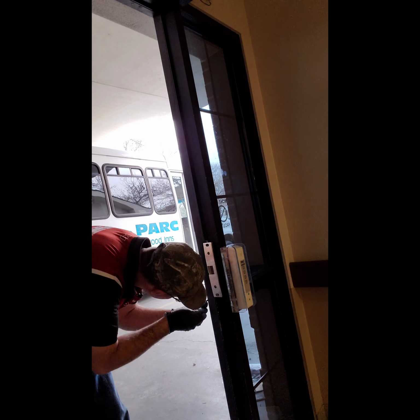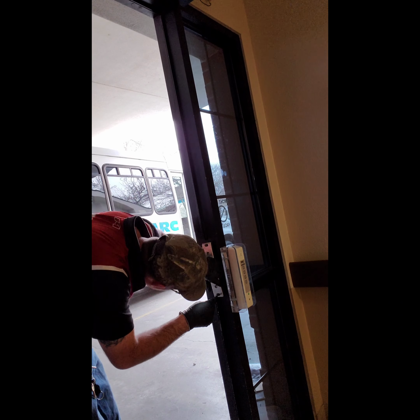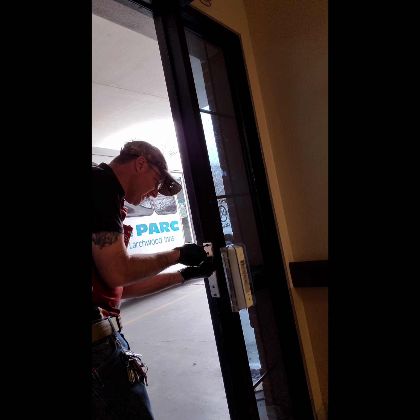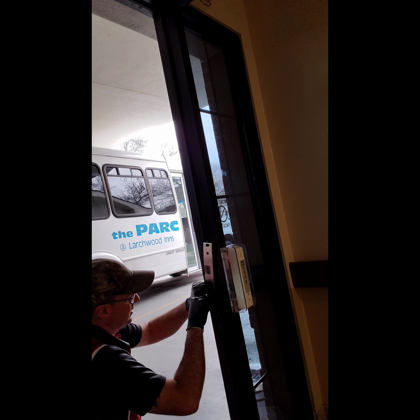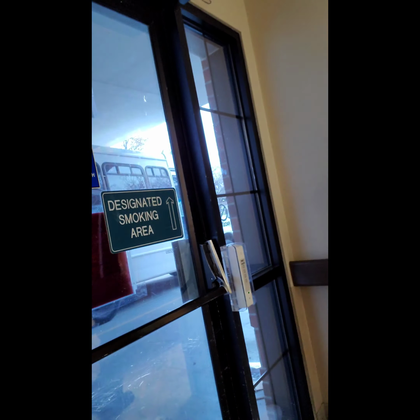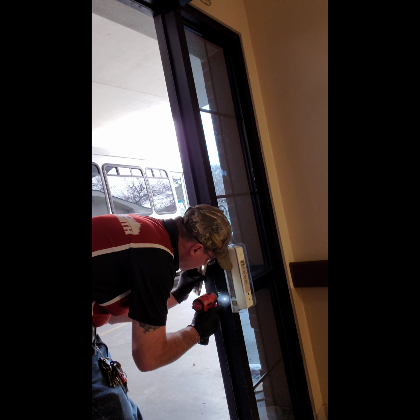There's a 12 and 24 volt plastic connection on that electronic strike. And the reason I had to open that up wider and actually angle it up was so that that plastic connection can actually fit down into the hole. That's what I was doing when I was making that hole. Probably 1/2 inch and then angled up on the side where the wires are so they do not become pinched as you go ahead and mount this strike.